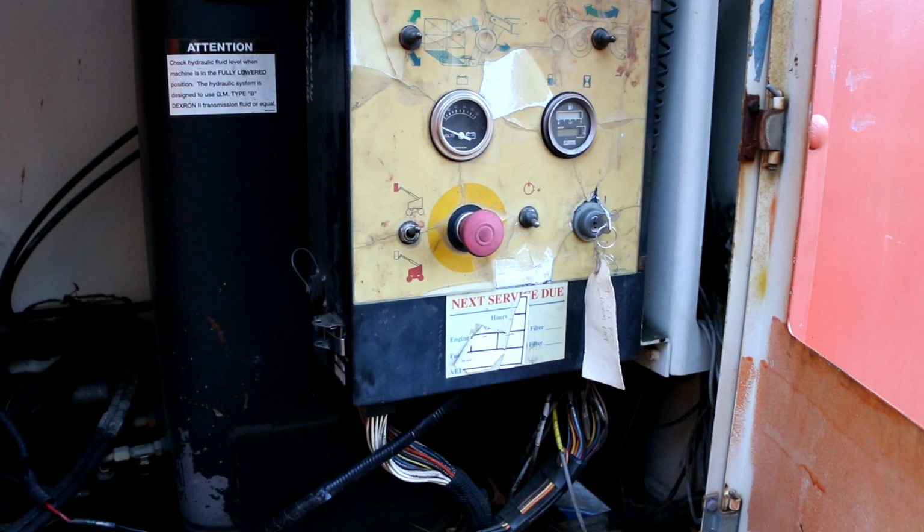Well, I just played back that video and got to see what you guys already saw, which is that it turns out the CPU doesn't start running, apparently, until you press the remote switch, the foot switch up there. As soon as I stepped on that foot switch and it idled up, that's when the CPU light started blinking. Then when I did the boom extend or retract, the input and the output LEDs flashed. So that tells me it was receiving a signal and it was outputting a signal. And then when I retracted it, it did the same thing.